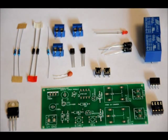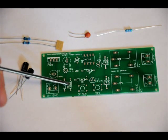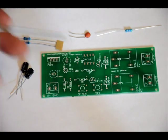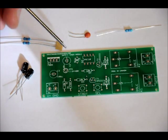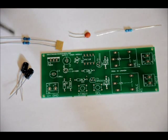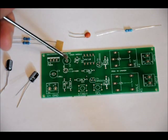First, I'm going to show you how to place the resistors and the capacitors. You've got three resistors — the two 10k and the one 470 ohm. It's actually labeled on the board. R2 is 10k, R1 is 470R for 470 ohm, and your second 10k ohm resistor is R4 right here. Your 0.1 microfarad ceramic capacitor is not polarized — both leads are the same size, it doesn't matter which way you place it. Place it in the C1 slot labeled 0.1u. Your two 100 microfarad electrolytics go in the C3 and C2 slots.